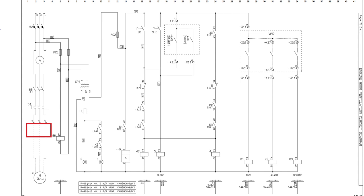We have a burned VFD and we need to bypass it so we can run the motor. This means we need to connect the input and output of the VFD directly to the motor. Since we are removing the VFD, we need to remove all its connections from the circuit diagram.